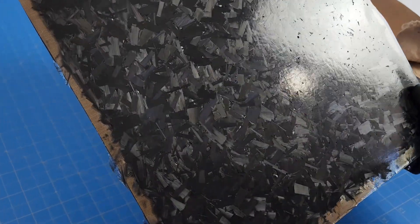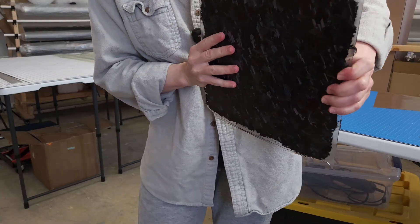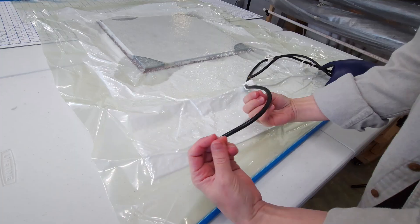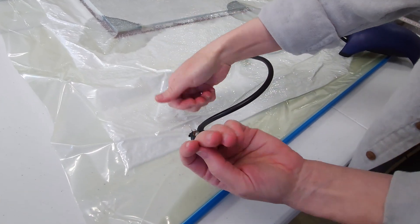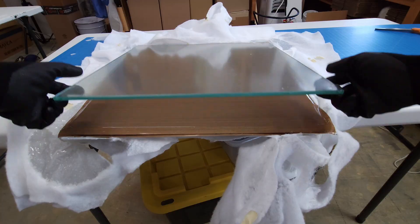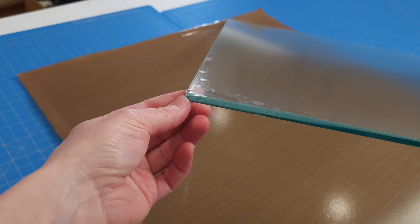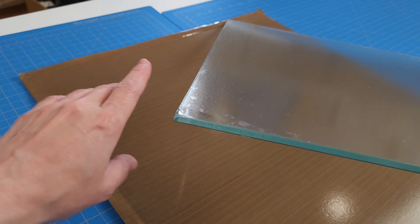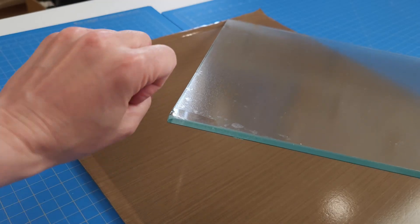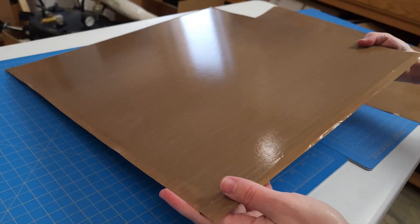That's not very good — that has a heck of a lot of pinholes. There's the side that's got the veil; it's not too bad. That is one heck of a rigid plate. I actually managed to break my glass plate — that's a first. I should have made the peel plastic out a lot further so more of that squeeze-out would have ended up far away from the plate instead of completely enveloping these corners. That was silly. Not bad, still some pinholes even in this one. Forged carbon fiber is just so prone to pinholes.